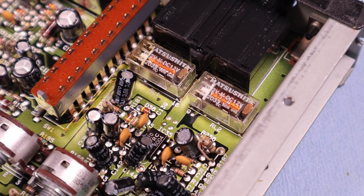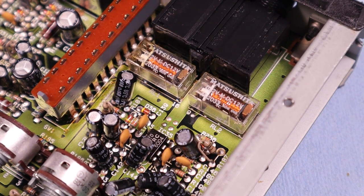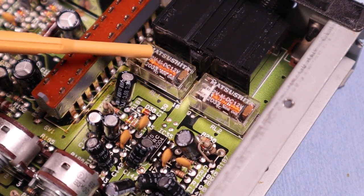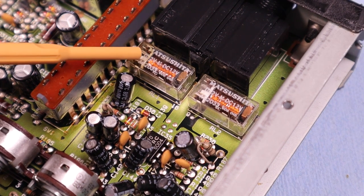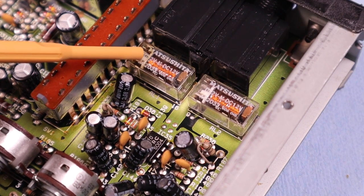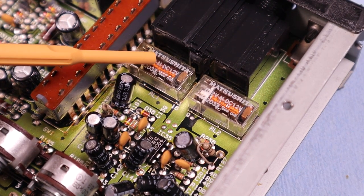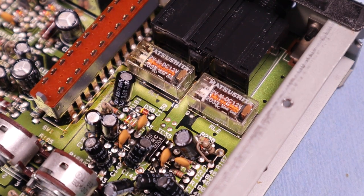Let's have a look at those relays. Here's a look at the two relays that the DEP5 has in it. As you can see, they're Matsushita, DS2VM DC12V. You can pop these covers off — I've done it before to clean the contacts in there and do a little lubrication — but you have to be extremely careful with that. They're really not meant to be serviced, but you can give it a shot if you absolutely had to. I'm going to go ahead and apply power to the unit. Let's listen to them closely to see what they do — they should click together instantaneously.